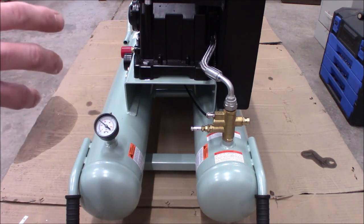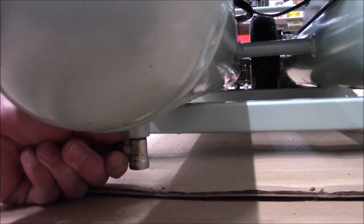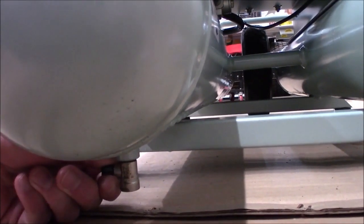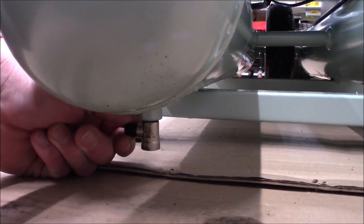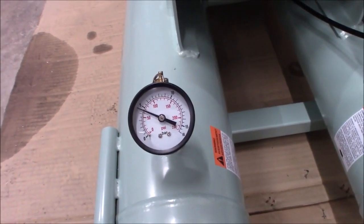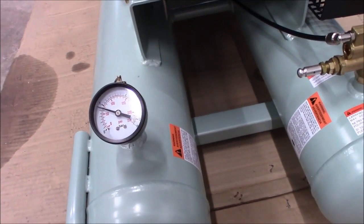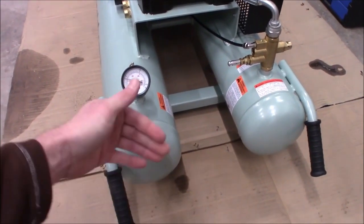How often you must drain is going to vary a lot depending on hours of use, total amount of air moved, and the humidity and temperature. Up underneath here, there's a drain valve for each side. Right now we're under about 75 pounds of pressure, so we don't want to crank this full open and have all that pressure escape. Ease the valve open — it's going to be loud depending on how much pressure you've got. You don't have to go full open, but when the pressure has dropped down quite a bit, come back and open it all the way. You really want it full open for any water to drip out, and you can tilt the other end down to really let that water come out.